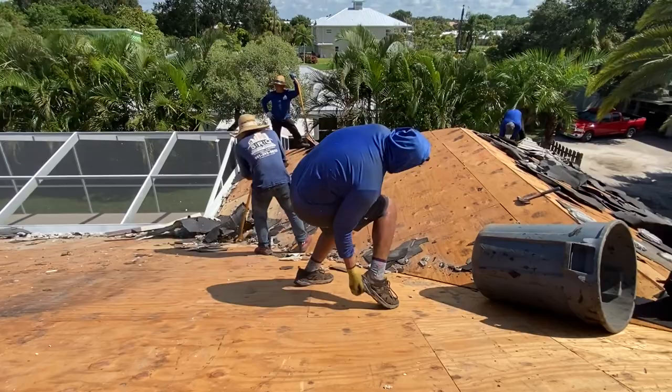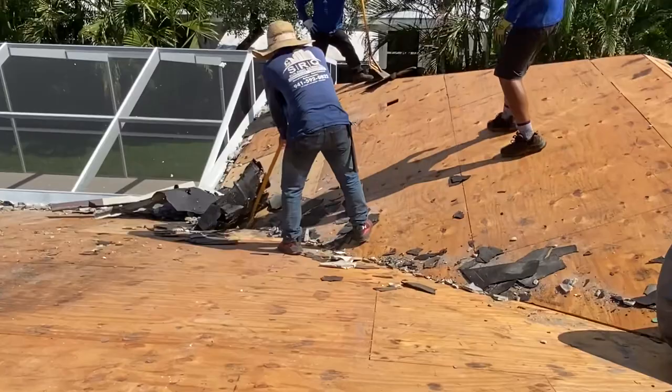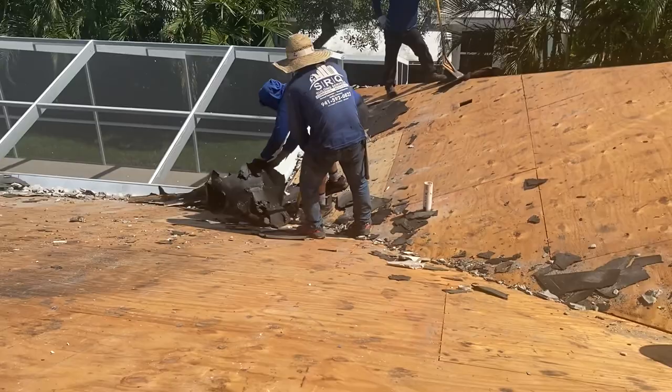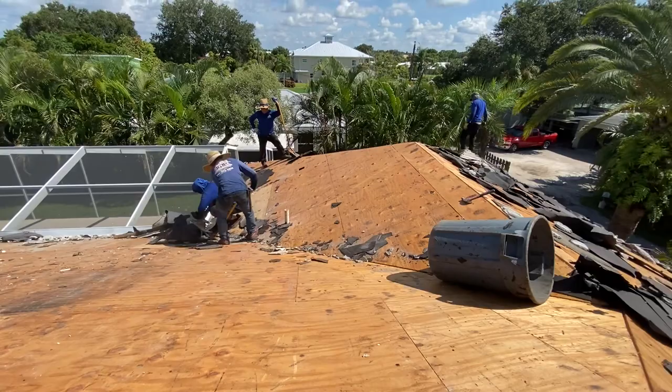You can see there are a lot of nails in the roof — they all come out and we re-nail the entire deck. The valleys are very important; that's where most failures are going to happen in any roof. So we take extra special care in getting the valleys cleaned out, double lining the valleys with new shingle and new underlayment. We use a poly stick peel-and-stick underlayment — it's virtually bulletproof, is what I like to say.